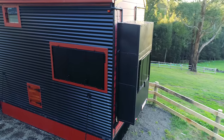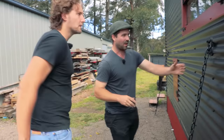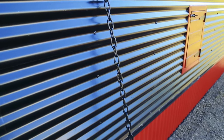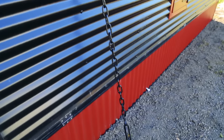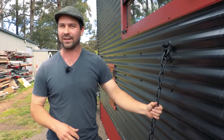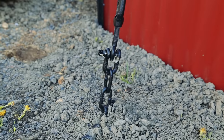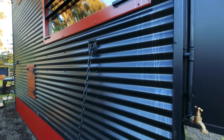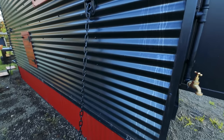What about these tie-downs? Being bushfire resistant meant a lot of extra weight had to go on, so the chassis had to be built very light. The trailer itself only weighs half a tonne, making it liable to flip over in a storm — until these tie-downs were added. They make an excellent anchor, keeping everything nice and tight.